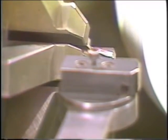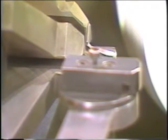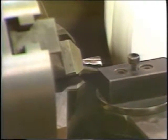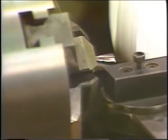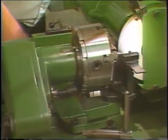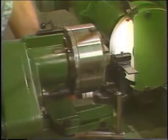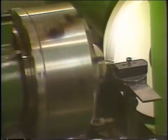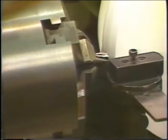When you get done though with grinding the core drill, usually you should also face these drills. So to do that, you would swing the workhead over till the pin drops in the locating hole so that the tool is in straight. Then remove the cam so the workhead is just spinning. And just face the end flat again.